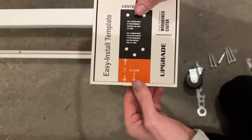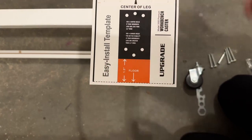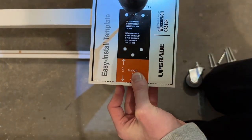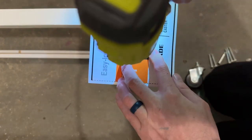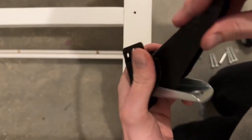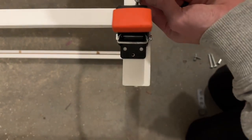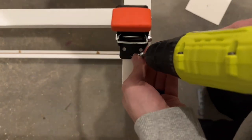My workbench is around two inches, so instead of putting two bolts in the center, I'm going to put one here and one here. I'll hold this at the edge of the leg and drill a pilot hole, making sure it stays right on top. Then drill the second one. Now take this bracket with the part facing downward, line up the holes, and screw it in.